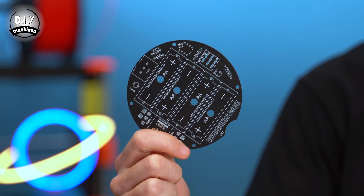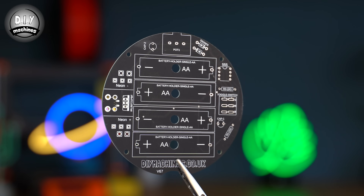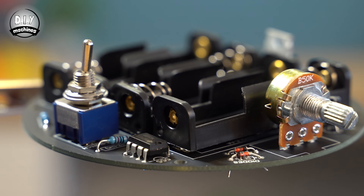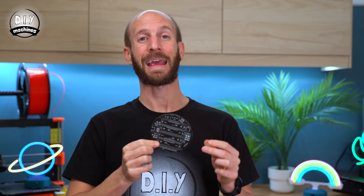As mentioned at the beginning of this video, I've designed a PCB which is what I'll be using to assemble the electronics. If you'd like to build your own circuit, then you can have a look at the wiring diagram found in the links below. I have tried to label the PCB so that it is obvious where each of the components should go. Some of the parts may fit in more than one orientation and it doesn't matter. But for some of the components it does matter, so I will step you through them now one by one. We'll start with the least tall of our components, the 555 timer, and work our way up in heights. This will make it easier for us to lay our PCB down on the surface as we're soldering them from the underside.